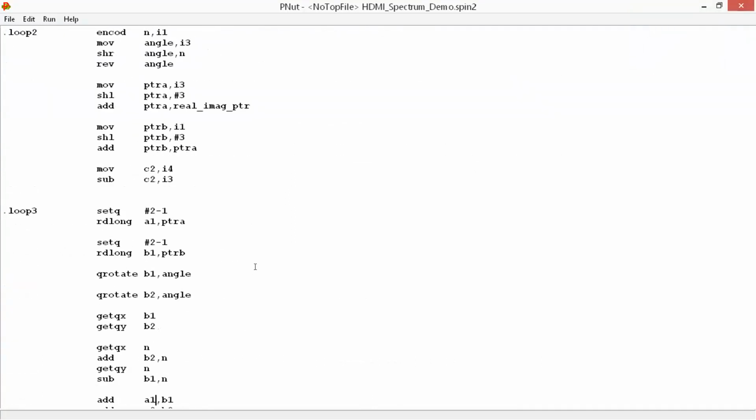He says that's exactly what he was asking. Excellent, close enough for a transient measurement to satisfy pretty much any FFT need. 3 milliseconds is already really good for 1024 points. Yeah, and if you want to do something smaller like 256, that would be 256 times log base 2 of 256, which is 8. That would only take, what, 2,000 operations? It should be 5 times faster. So 1/4 the points, but 1/5 the time, is that right? 5 times the speed, or 1/5 the time.